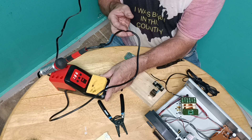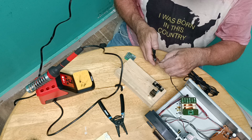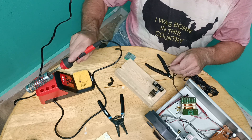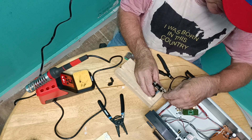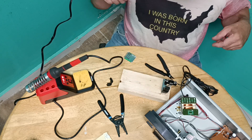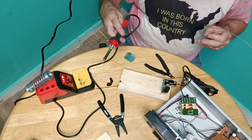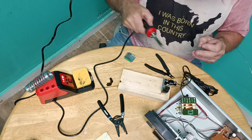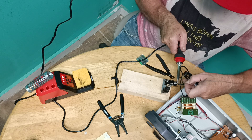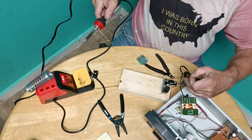It's going up to 733 — that's pretty good. It melted the solder really quick. We'll stick our wire into our terminal. I'm going to make sure all the solder ball is off there. We'll go into our terminal like this and use this to hold it up while I solder it. Tin the iron a little bit. Heat it from the bottom and solder from the top. There we go — we've got a very nice solder joint here.